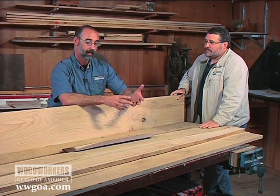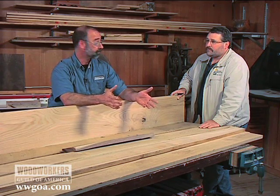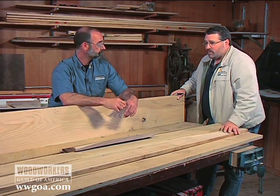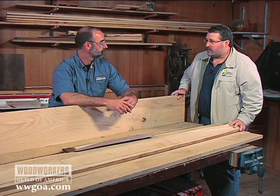Line two edges, and I could get that lumber taken right down to a specific width. Correct. Yep, and we can rip one board at a time to a certain width, or we can set up what's called a gang rip, where we could take boards and rip everything to 1.5 inches, 1.625, 2 inch, and basically it takes the same amount of time for us to rip a board into 6 little pieces as one straight line, because we just add additional blades there.